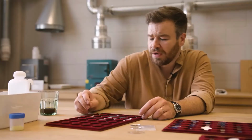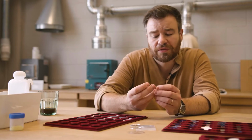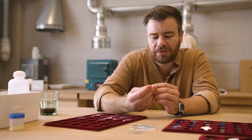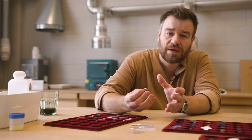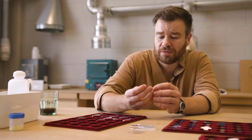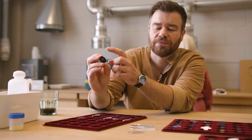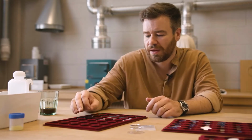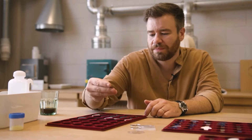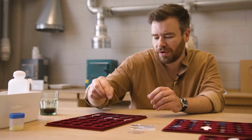It's really delicate. Some of the early experiments took a good year or two, because every time we tried one, we had to recut the tool to stamp a new one. This was an early one done in copper, and you can see the dome's too high, so we've polished through it and it's gone to the copper there. This one was slightly better, but it's still gone too far, and there's no real gradient. It's just deep blue and then a bit of exposed copper.